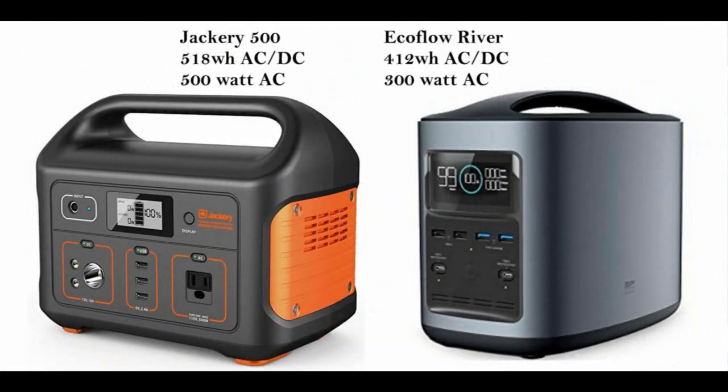Hi guys, this is that girl. As you know, I'm into these solar power stations. I have two small ones — an EcoFlow River — and I've been playing a lot more with this Jackery 500. I bought a 100-watt panel since the spec says it handles 100 watts of solar, but when I run it I only get about 50 to 55 watts. A little disappointed — I thought I'd get 90 watts or something. It's getting more into winter and the sun isn't as strong, but still I thought I'd get a little better than that.